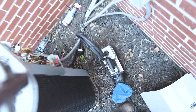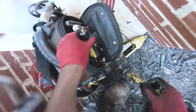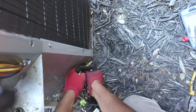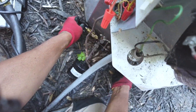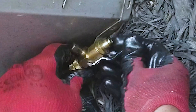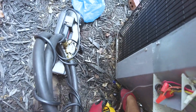I'm going to use my bigger hoses today. I'm going to grab both of my clear core removers — one on this side and one on the liquid side here. Always make sure you can open and close the valves. That one's not going to open and close, so I won't use that one. I'm going to grab our external vacuum gauge — CPS — and pop this onto the T here.